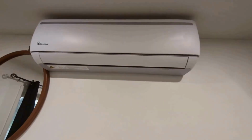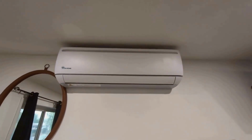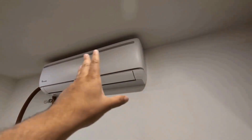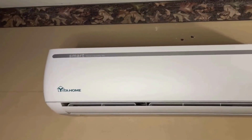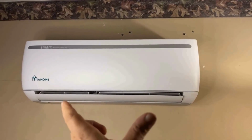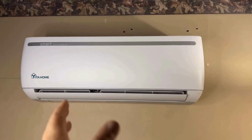On energy use, the inverter behavior showed up on my bill. I replaced multiple old window units with this single system and saw a noticeable drop. I can't promise your numbers because homes and climates vary, but the 18.5 SEER2 claim tracks with how often I heard the compressor cruising at low speed instead of blasting at full tilt.